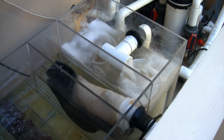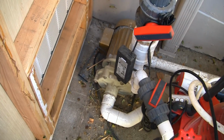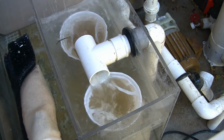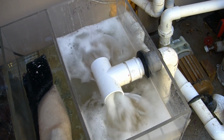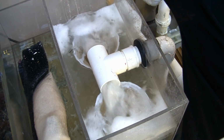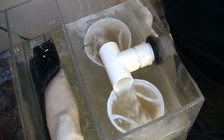We do have one challenge already presented to us, and that is the people who installed the tank have a large Reeflo Hammerhead pump that I believe is supposedly doing about 1,600 gallons an hour. More than that. Unfortunately, they only put a single 2-inch drain out of the tank, and so what we end up with is a siphon, the office water cooler effect, because as the internal overflow receives the water, it can't swallow all of it. So at some point it creates a siphon, which in turn allows the water to roar out of the tank, making a whooshing noise.